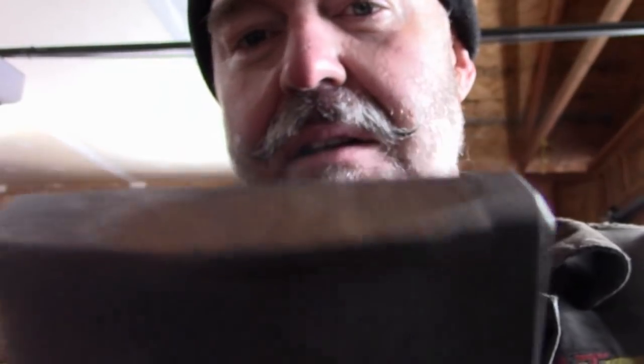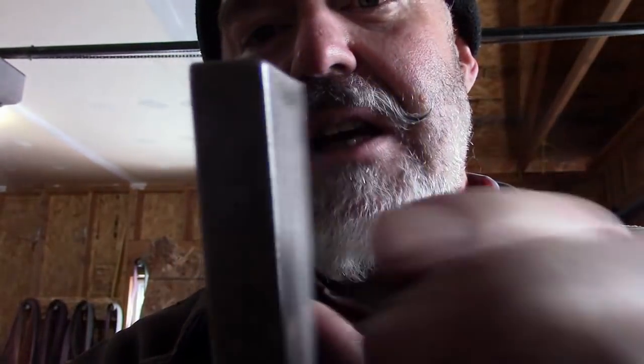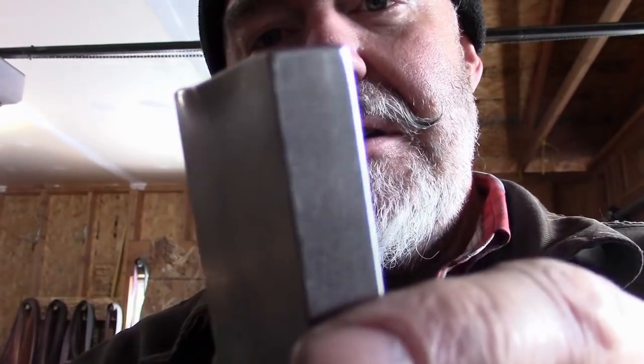I mean, that's a lot of deflection for, I think that was 4 or 5 heats. And if that happens, that amount every time I put steel in this, I'm going to have to replace these dies every month. So, I think if I weld something on the top, it will prevent that, but that's the only thing.